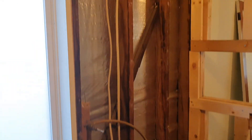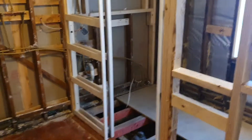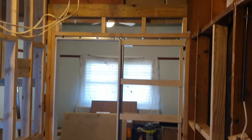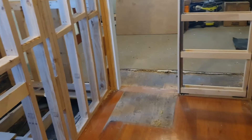There's a lot of hardwood and so forth in here. We've also modified the bottom of the window — the window has remained. It's a really nice big window that offers natural light into the bathroom, and it'll also come through this doorway in the robe and offer natural light to that end of the room as well. You can see we've reframed and put in a new frame here in this wall. This is all non-load bearing work in this project — it's just internal framing to reconfigure the rooms to better suit a master suite.